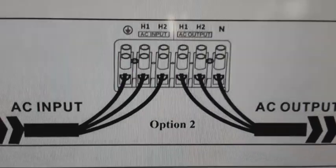On the Ames inverter, it has a ground, right? Just a pure ground. It has a hot leg 1, hot leg 2. That comes in from your power source. This is to energize the 120 volt, aka 240 application. On the AC out, check this out. On the AC out, it does have a hot leg out, and a neutral. There is no ground.